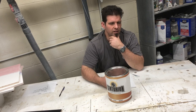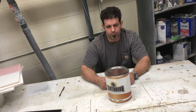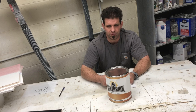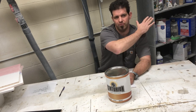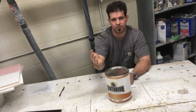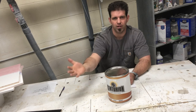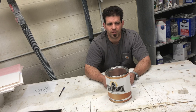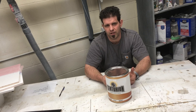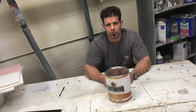The drawback to the clear-over-vinyl approach is that if you scuff through the vinyl sealer, you have to touch it up and re-clear. Imperfections like dust nibs show up more under a clear than under a tinted coat. I like to use tinted products wherever I can — it just makes life easier, especially if you have other guys working for you who aren't as careful. That wraps up why I like vinyl sealer.